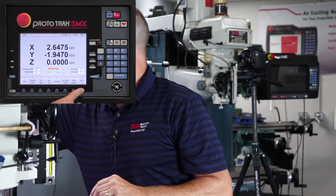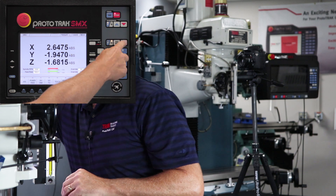If I take tool number three out and put tool number two in and tell it it's tool number two, it's still going to say zero on that readout. But if I don't move anything and I go to tool number one or tool number two, you're going to notice that there's a number in the Z axis — that's how much the head is going to adjust to make that tool touch the same Z zero.